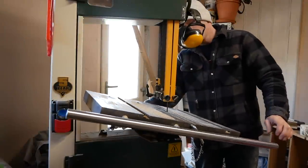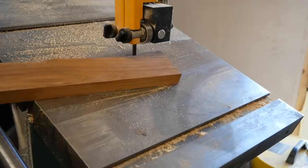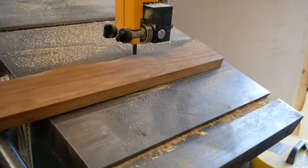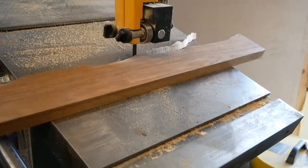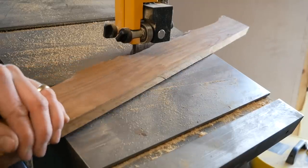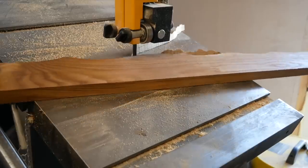After a test fit, it looked like I needed to remove a little bit more material behind the scribe cut. That's because it's a thickish piece of wood and the stone is very irregular. I'm not actually changing the scribe line at this point — I'm just taking away a little bit of timber from behind by cutting it on an angle.